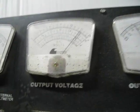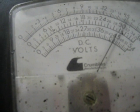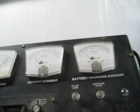We cut the machine on and powered it up. Right at about 15 volts. The amperage isn't doing anything — maybe 15 to 20 amps without a load. Keep in mind this is on a bench tester so there is no load on it at this time, which is why there's no amperage. We'll load this thing up at about 700 RPM and show you what kind of amperage and voltage we're getting at idle.